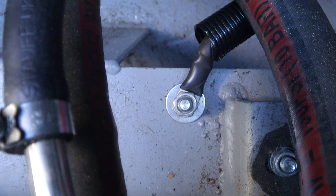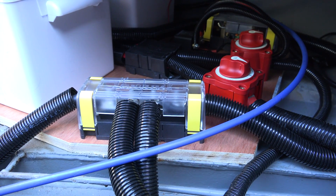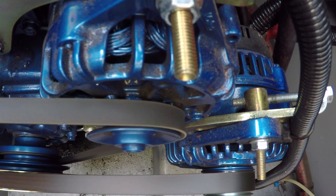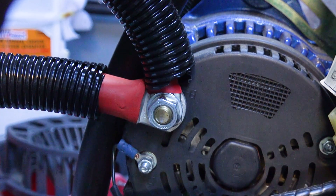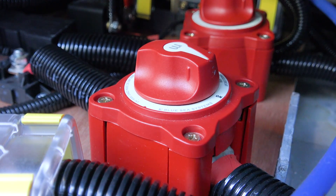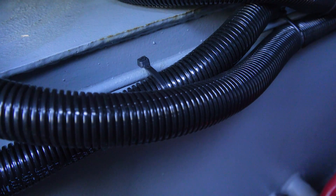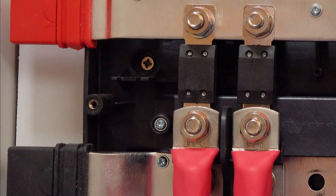Unlike a vehicle, it's highly recommended to not use the hull as the return negative. All items on board should, on a new install, use two wires: positive flow and negative return. The 175 amp alternator has two feeds from its positive connection. One goes to the isolation switch for the alternator protect battery. The other, along with a negative from the bus bar, are protected in plastic corrugated conduit through the bulkhead and into my lithium cupboard, where the positive connects to a fuse on the bus bar.